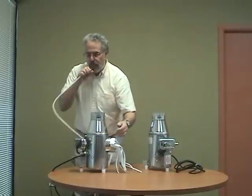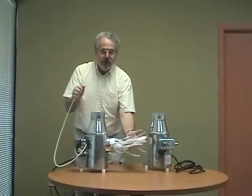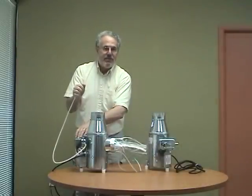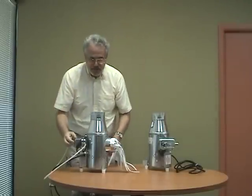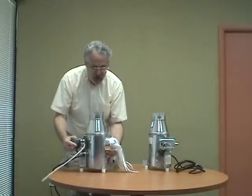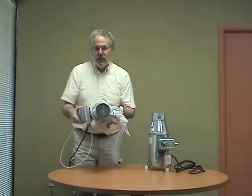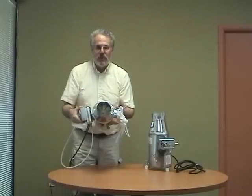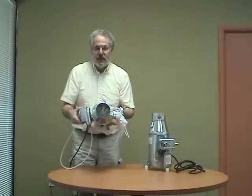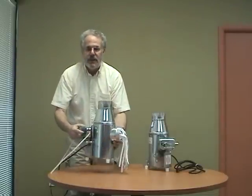When the dryer starts — which is the same as me blowing on it — it will kick on and continue running. When the dryer shuts off, the switch will sense an opposite change in the dryer duct and turn the unit off. As you look at the way the unit works, there is no place for lint to collect. There's no motor, no motor mount, no blower wheel, no blower wheel housing. All you have is the axial fan blade, which gives you plenty of force to keep the lint suspended in the airstream.